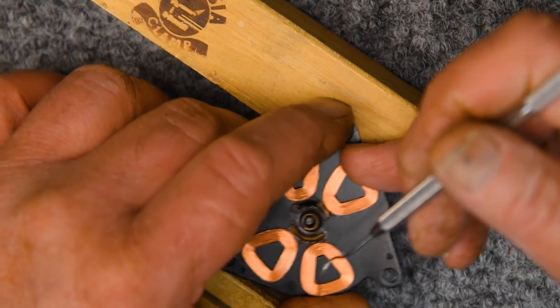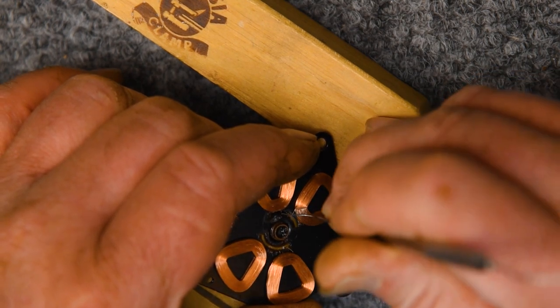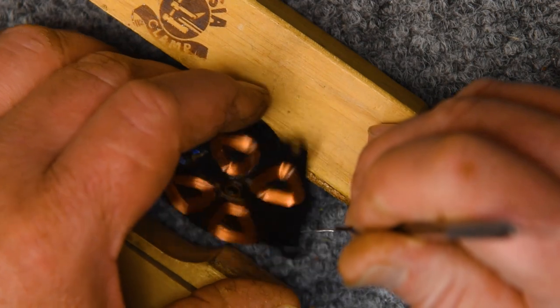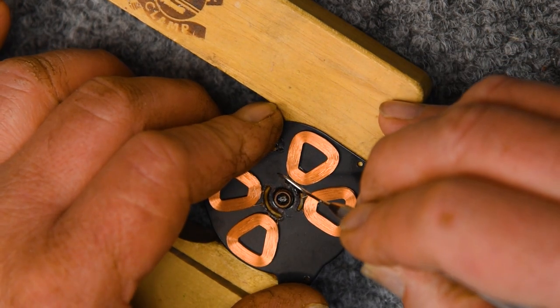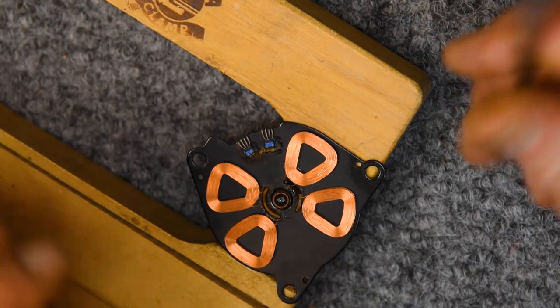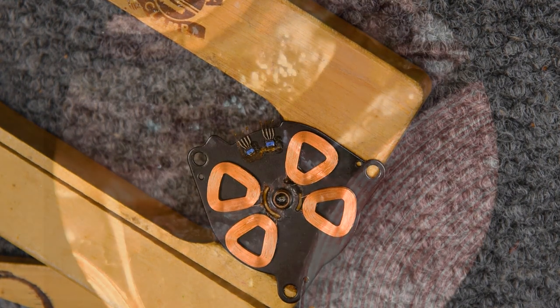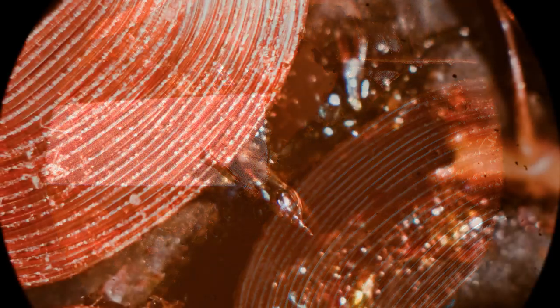And it left me a little tiny stub right there to solder onto, and I can do that, but that's obviously right where it got pulled too hard and got kinked, and that's the result. So I did get that soldered. There's what it's left me with. And I did get the insulation scraped off of it. I put my tiniest screwdriver there and scraped the insulation off, and I got a new lead soldered onto it.